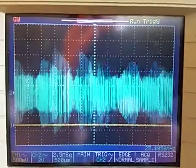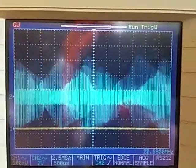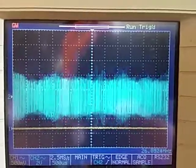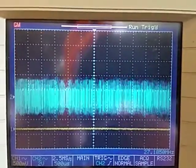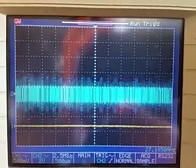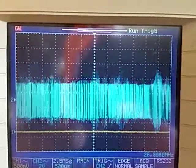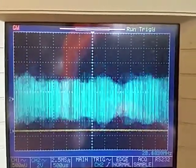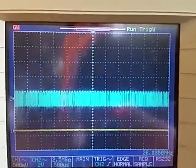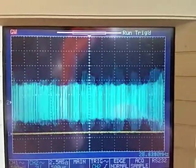Watch the horizontal bar right when I stop talking. That's the carrier level, and as you can see it shifts up when I modulate and falls down when I throw a dead key. Now the other interesting thing is the modulation limiter doesn't always catch the spikes in modulation. See the triangular waveform when I make a fast response — that's because it takes a second for the modulation limiter to catch up.